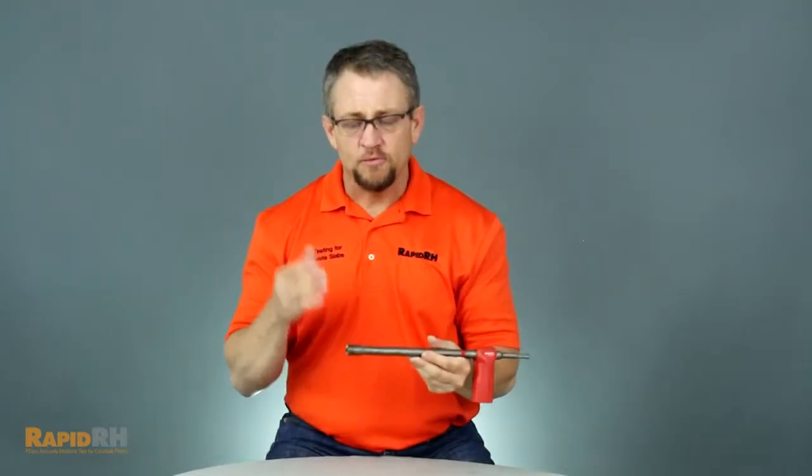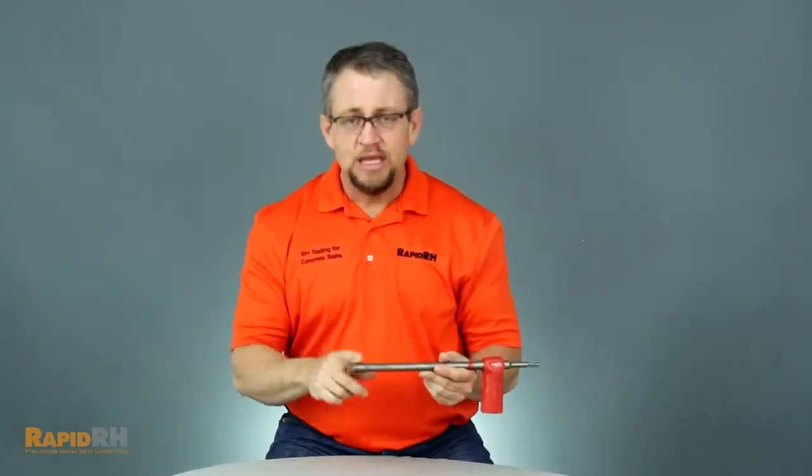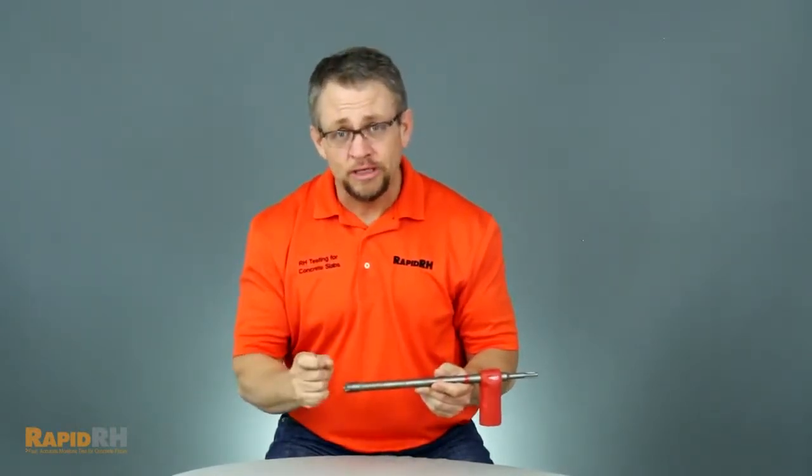The great part from an efficiency standpoint is the fact that it only has carbide cutting heads on it — it doesn't have the fluting in the shaft. What you'll notice when using this is: A, it makes a very clean and uniform hole, and B, it lasts a very long time and drills holes extremely quickly, because it is only drilling and not also having to extract the debris to the surface of the slab.